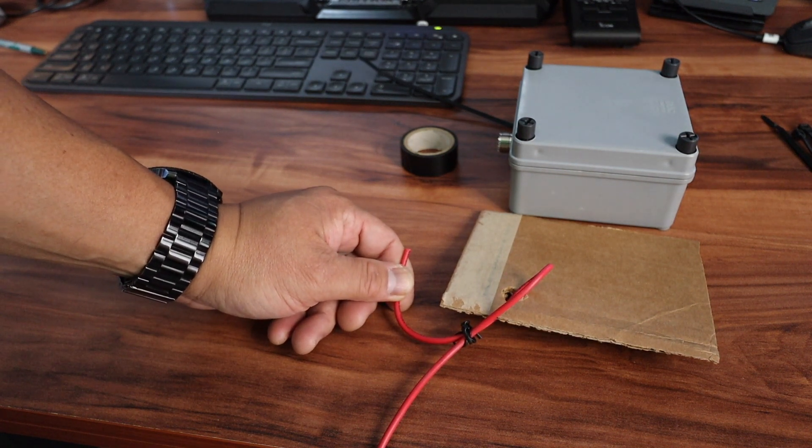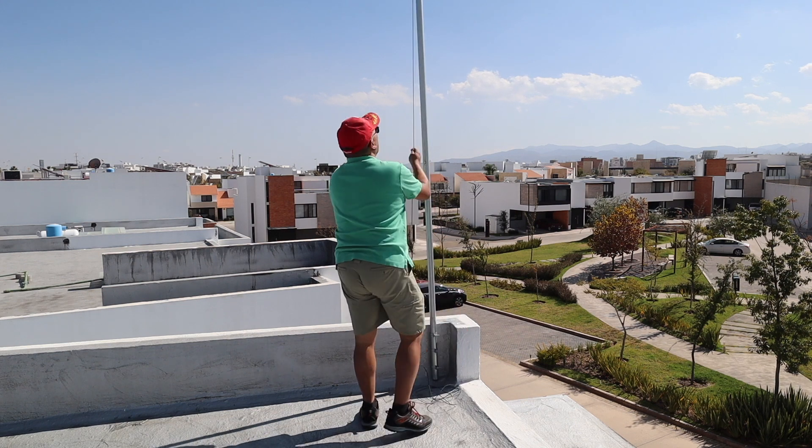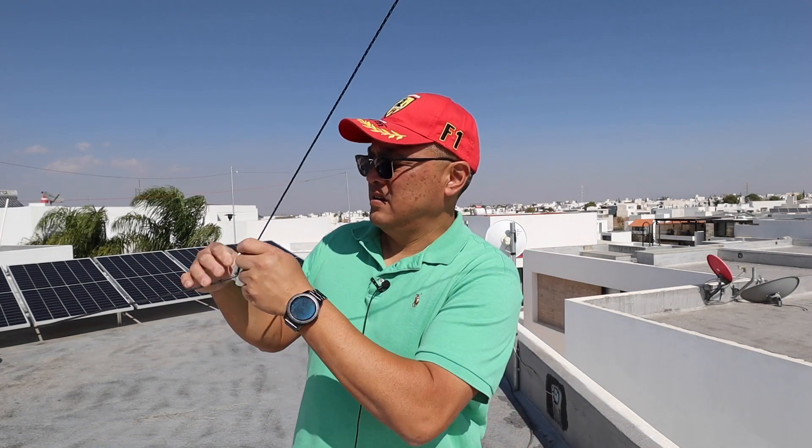I'm on the roof and I'm going to first loosen the majority of the insulator, just lower it a little bit. Then I'm going to go to the 4-to-1 balun over there and bring that down, drill the holes in the back plate to prepare for the tension relief on the 14 gauge wires. I think this is enough slack to lower pole number one — the left front side of the house — that's the one housing the 4-to-1 balun.